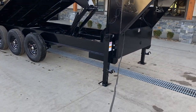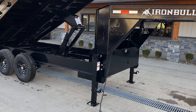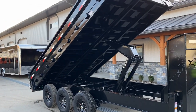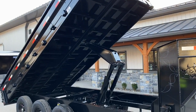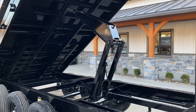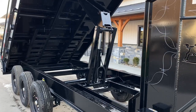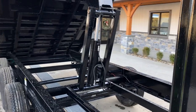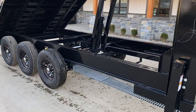Generally, you're going to get about a 20 foot remote cord on these. They're designed so that you can go up to your truck and dump from the truck on a cold day or whatnot. It says a scissor hoist lift. That's pretty common on most of these. Normally, when you go to a triaxle, you're going to get a little bit longer stroke, as is on this one. So this is a 520 hoist, 10-inch I-beam frame.